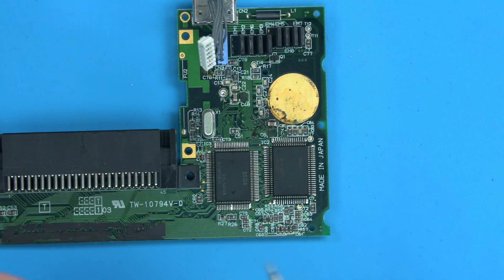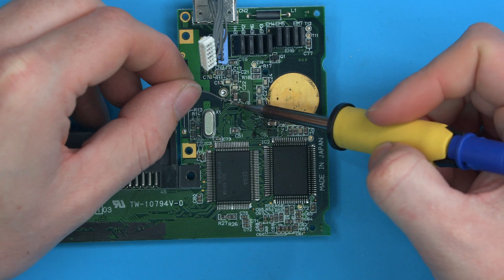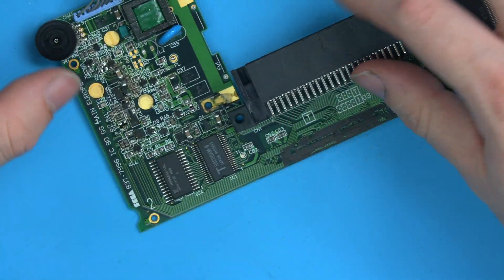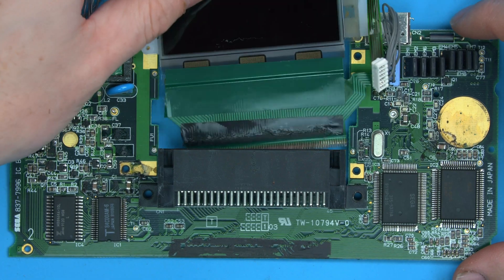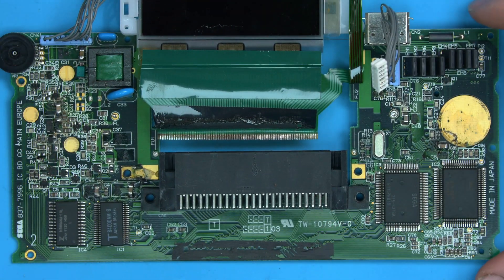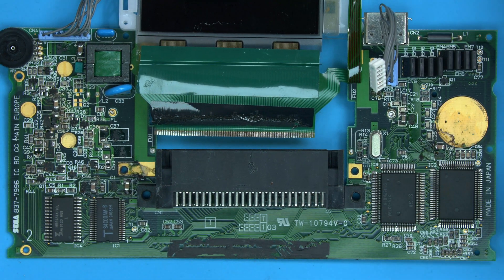If you really want to, you can then go around with your iron after they've been hot aired and just tack a bit of extra solder on to tidy up the connections. If you do it right, however, they won't need that — they'll be naturally flowed on with the hot air and look just right. That's now a stripped board with a completely reusable original screen. All these pins are completely reusable and the caps are on that we need for a modern screen replacement. Hopefully this helps you guys cut down your labour time when prepping Game Gears for mods. You don't need to mess with all the solder, take forever scraping and cutting, or put half the capacitors on. If you're interested in anything else you want to see me mod, fix or repair, just let me know and I'll see you in the next one.